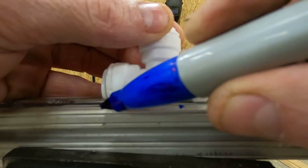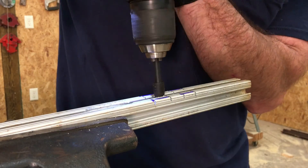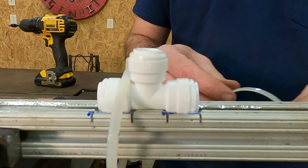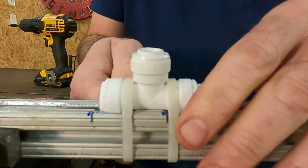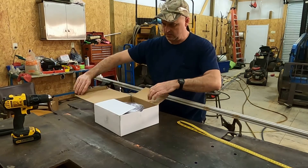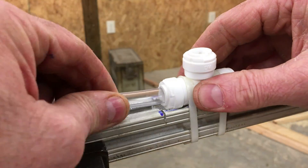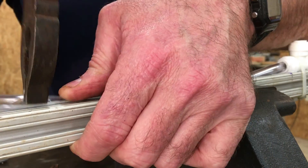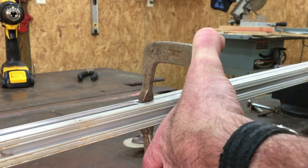The grade rod is what we use to measure the differences in elevation, and it's basically just a pole or a stick with a graduated scale of some sort attached to it. It can be made from any sort of rigid pole such as a piece of conduit, PVC pipe, or even a two-by-two wooden board — I used a piece of one-inch aluminum T-slot rail to make mine. I'm going to install a quick-connect fitting so I can easily disconnect it from the transfer tube, and I'm going to use a T-type fitting because it can be attached more securely than a 90-degree elbow-type. With the fitting in place, I can now install the new tubing, using pliers and a vice grip clamp to wedge the tubing securely into one of the slots on the T-slot rail.